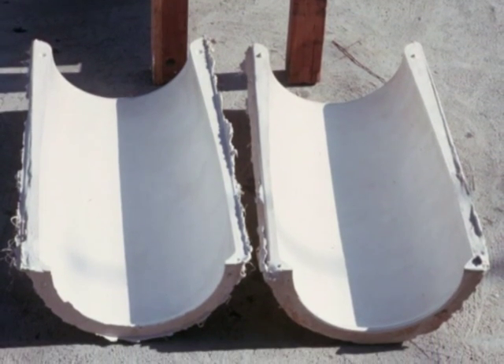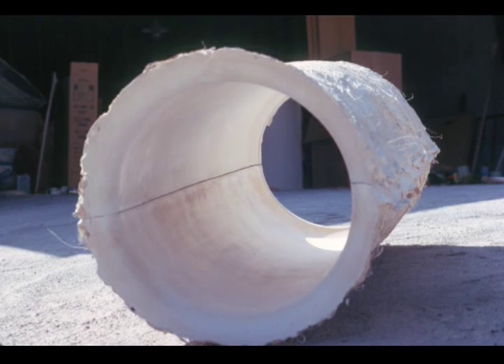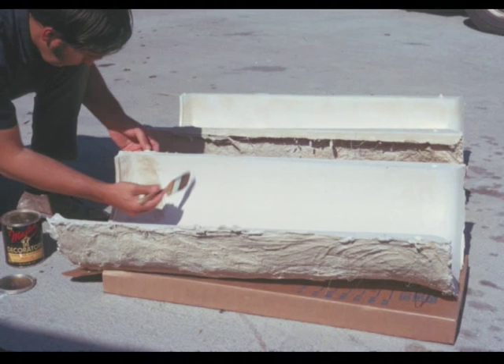This shows the cast removed from the master model. This view shows the shells or molds reassembled in the proper location. This will be the actual tool assembly configuration when the fiberglass is laid up, and this is another view showing the continuity of the surface. In this view the plaster is sealed with a lacquer sanding sealer; these will be sanded and smoothed to make the actual surface.